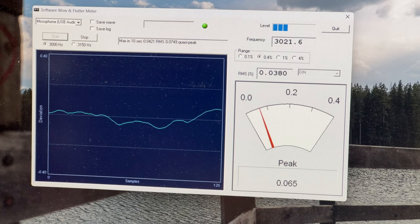Before I continue, as you can see, I did all these capacitors and all this other crap I had cleaned up here. All that junky brown circuit glue, and there's more under the underside of the audio board that you have to clean up too, which I have already done. And you can kind of see what I've got going on in here now.